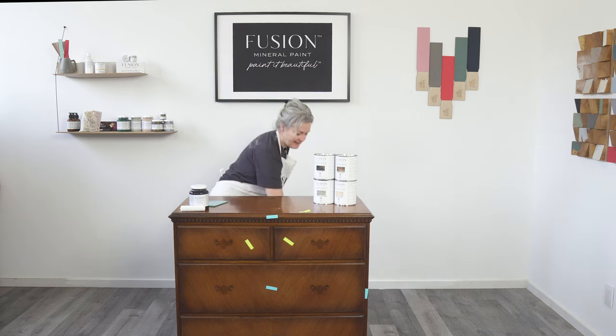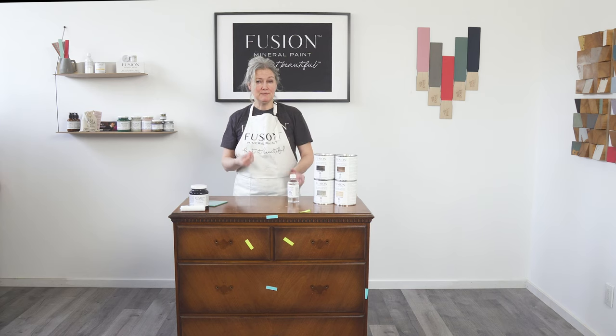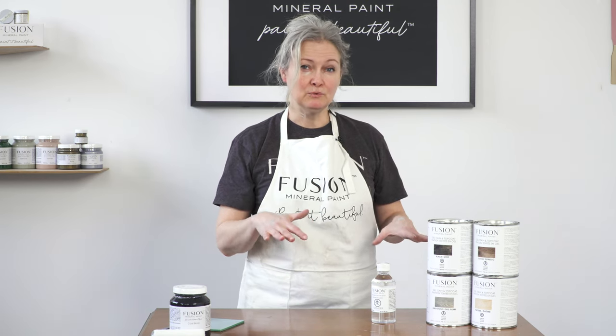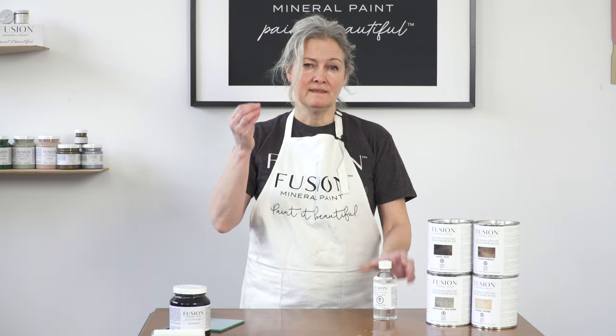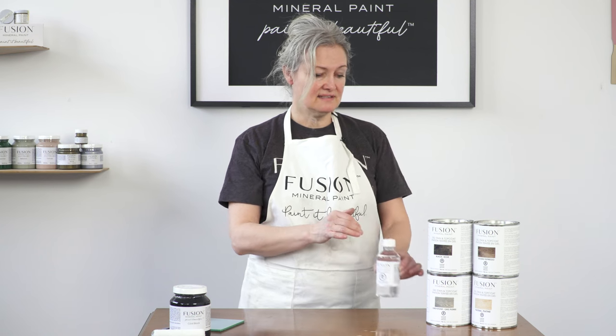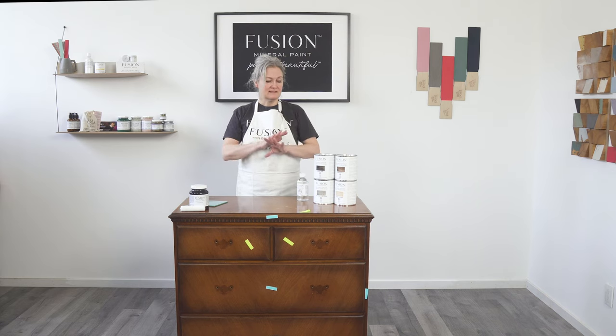It comes in four colors and it's very thick as is. Some surfaces you may need to thin using the odorless mineral solvent. What it will do is thin it enough to either penetrate into a bare wood surface. For instance, if you have open-pored wood such as oak, you definitely want to thin your first coat so it goes into the pores and fills them. Subsequent coats will use less solvent, and you can finish with a solid, unthinned finishing coat. The other thing is it dries in a matte sheen, so you can put one coat after another and it will always be a matte, super washable surface.